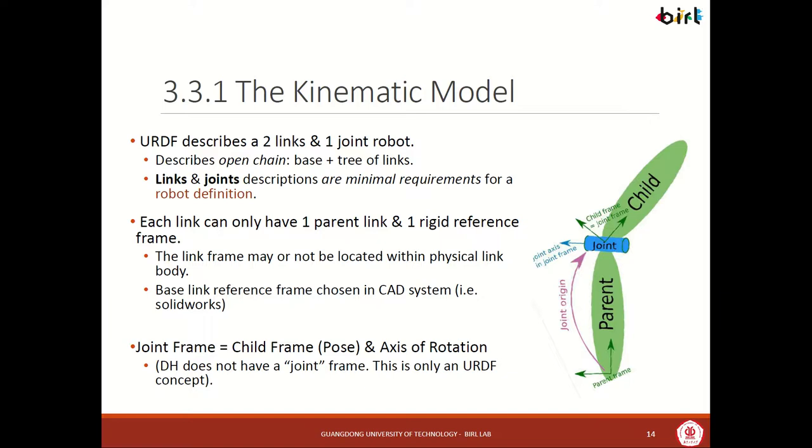Right now, for example, you can think this is the y-axis, so it means this link could rotate this way. If this link was pointing in this direction, then it would mean that the link can do something like this. So you also have a joint axis that determines the style of the rotation. Like with this elbow, we can do this, but we cannot move like this. I would have to rotate my arm to be able to do that. So the joint axis defines, in the kinematic model, how the robot can move.